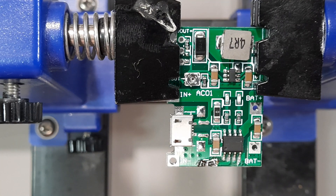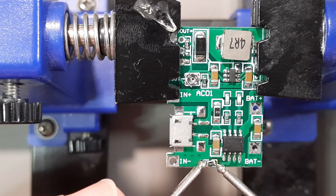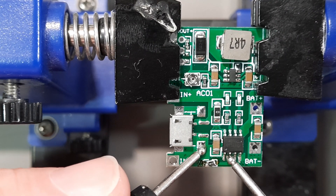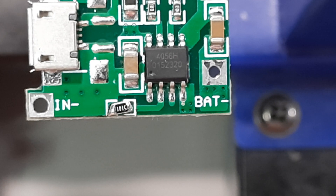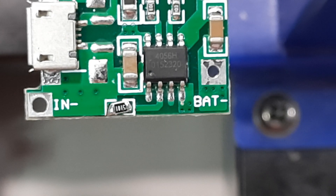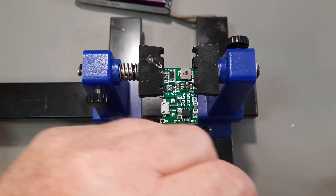Let's see if it actually worked. I'll put my meter in here — 5.14 — going from this point here to that there. Good, it actually worked. After a bit of cleaning with some isopropanol it looks not too bad. I think I was using a 0805 and I suspect that was a 0603 resistor, but it fits. Now I'll attach the charge board.